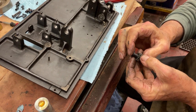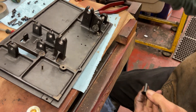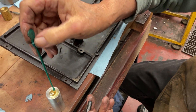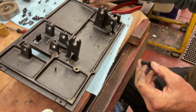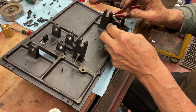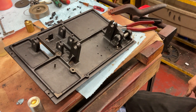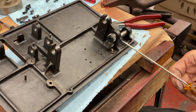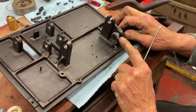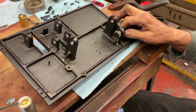Remember I told you this was bad? I machined a new one — a new pin for the top one, and the gear. We're going to put a lot of STP right here, because this will never ever get oiled again. The other one when I took it out was absolutely worn out. It goes in here like that. Line the gears up. Excellent. Now we have to play with the tension. Remember on previous videos I re-reamed this hole out to fit. Very little gap there, and it's spinning smoothly with the STP. And that's all there is to it.